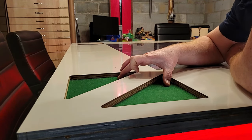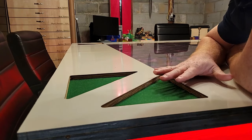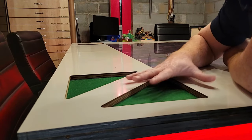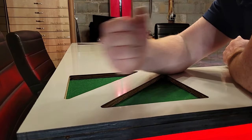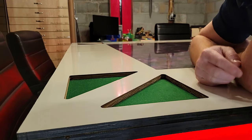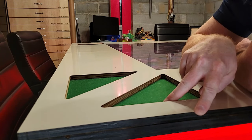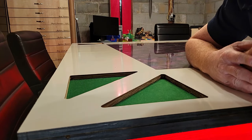Looking at the dice trays, you can see the two layers I mentioned on top of that three-quarter-inch base — the plywood topped with whiteboard material. I have a green felt; it's one big sheet of felt glued to the first layer, with a different color in each corner. For the next two layers, I cut a triangular shape out first using a router following a template, then flipped the template for the other side, giving two matching triangles. It's an eight-inch triangle, creating two inches of space on each side within the 12-inch-wide whiteboard sheet.